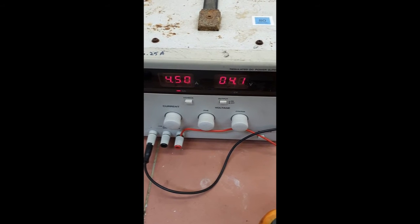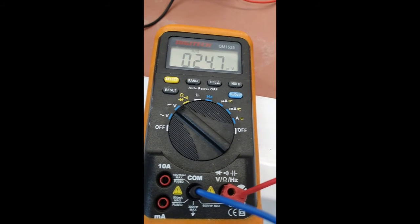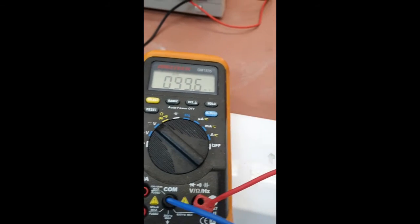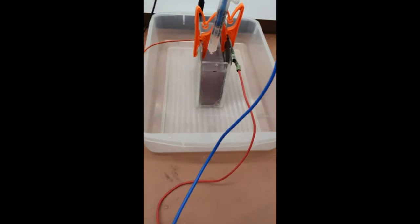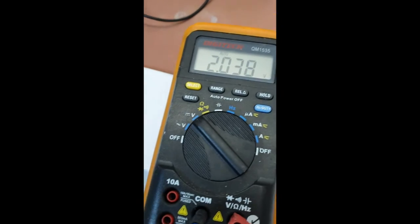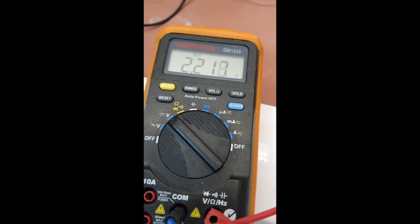You may have noticed that the potentiostat is giving us a voltage reading of about 4.1 to 4.2 volts. This is known as the total cell potential. If we want to break this down into the anode potential and cathode potential, we use what's called a voltmeter connected to a silver-silver chloride reference electrode. For now let's just do the anode readings — one close to the anode while connected to the anode, giving us about 2 volts, and one far away near the cathode while still connected to the anode, about 2.2 volts.